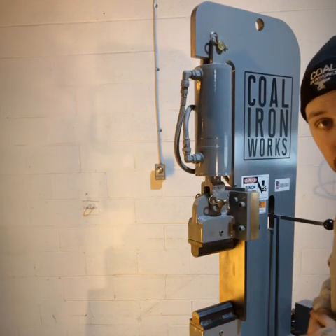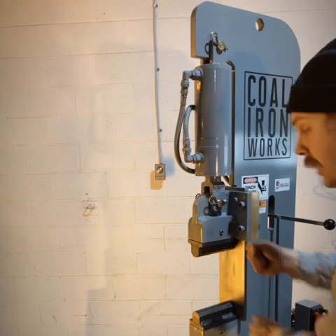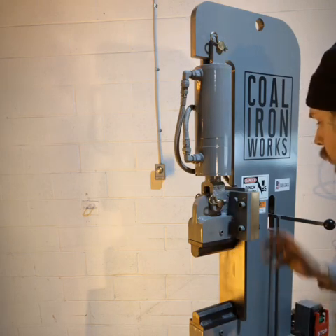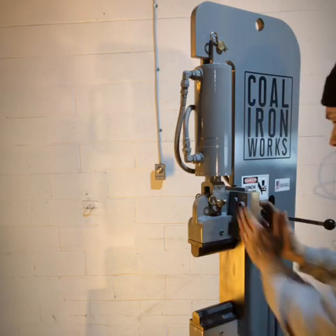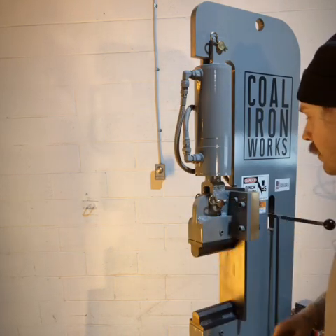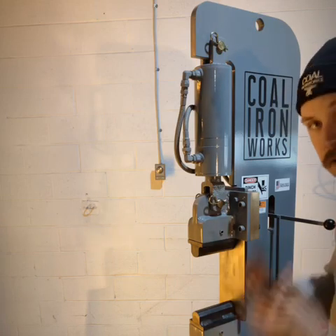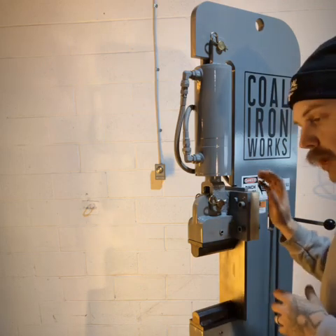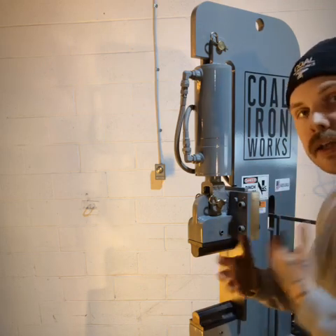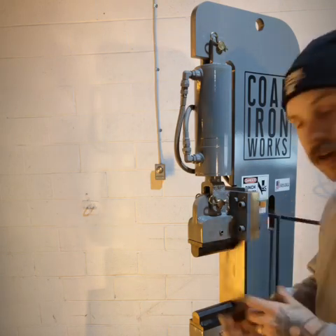If this is the first time you're running this machine, we're going to make sure we've got our spacing behind the top die. The dies have been aligned and tightened already. I'm going to turn the machine on, run it up and down, and inspect to make sure everything's nice and tight and working properly. This is an excellent opportunity to apply a little bit of way lube to the machine as it's running initially, really breaking in the bronze. These bronze wear plates are going to wear in to any irregularities in the steel plate, making a really nice tight fit.